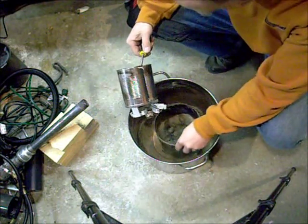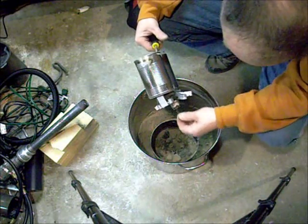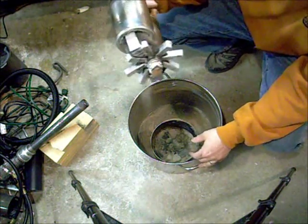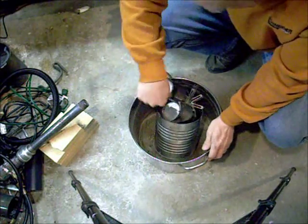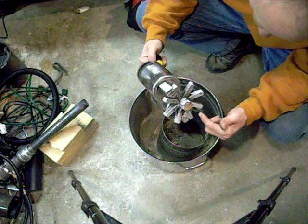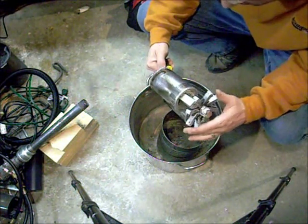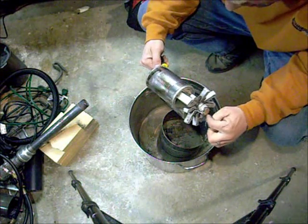It almost got there. The bottom, the core held up, but it didn't make it into the bottom. We didn't have enough in there. Look at that. Ooh, hot. Sand falling on my hands, hot. Jeez, we were close. And it kind of got crushed down a little bit too when we were crushing it down. But it didn't make it around that little edge. There was just too little bit there.